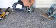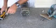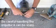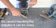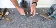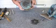Okay, so we've got our bracket, our shaft extension, the seal's inside of here behind the impeller. What I'm going to do is take a 7/8 inch end wrench. This is going to lock the shaft. Most all of them are this size. If not, a small pair of 6-inch adjustable channel locks will work. We take the impeller wrench, we unscrew the impeller. Here you'll see one side of the pump seal. Here's the other side of the pump seal.